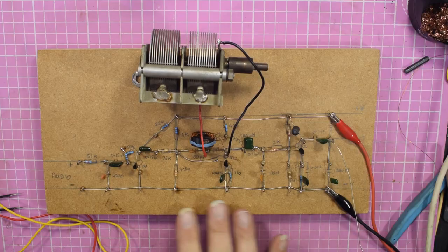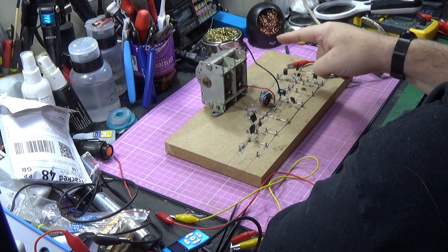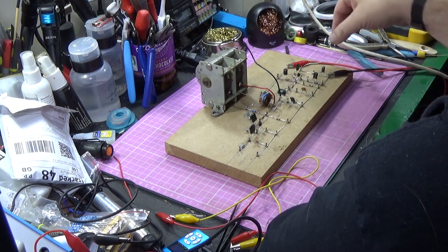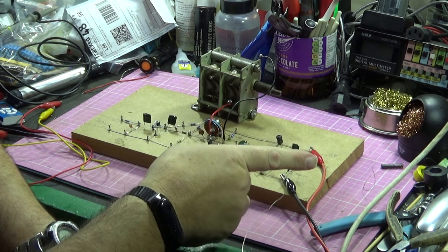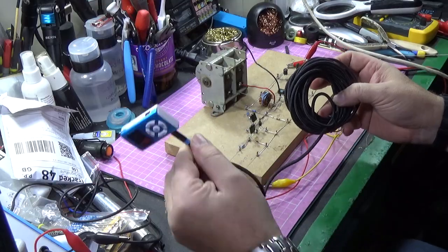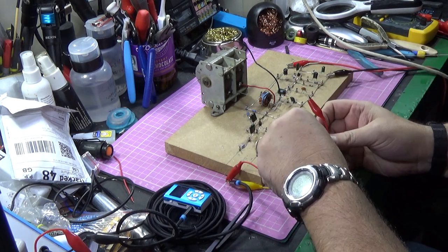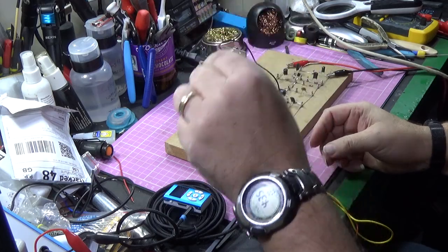This is the entire board wired — basically everything done. You've got the three transistors in, the capacitor wired in, the inductor there, the little choke inductor, and I've soldered the roll of tinned copper wire to the antenna socket. All I've got to do now is plug in the audio source.